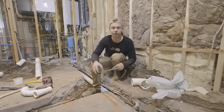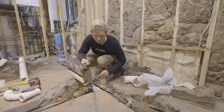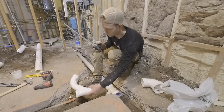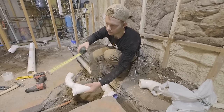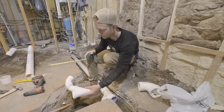Out of the end of this three-inch pipe we're going to be running to the toilet, but we've branched off with a three-by-two Y and then we're going to be installing this turnaround fitting. The reason we put this on here is so that we can get within five feet to that shower — because five feet is the maximum trap arm length.